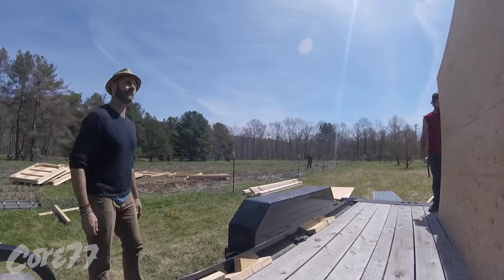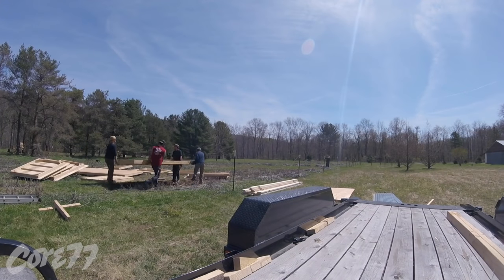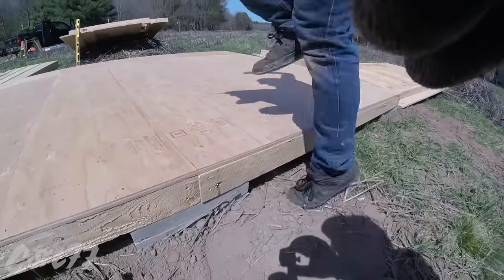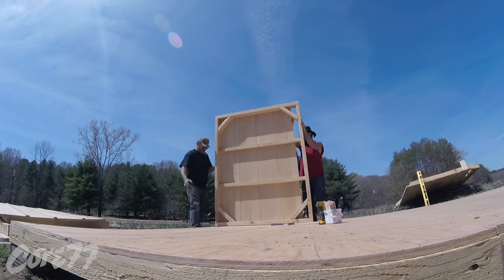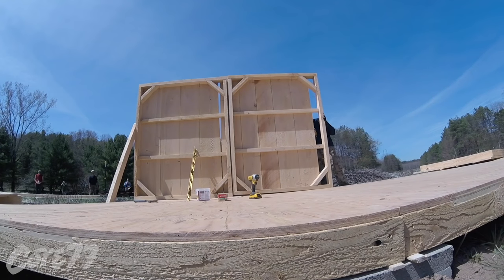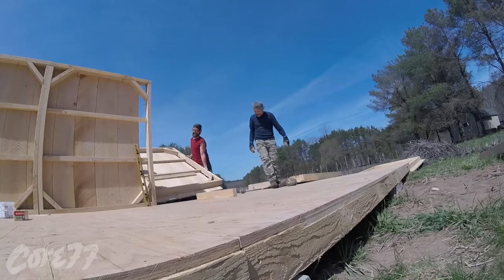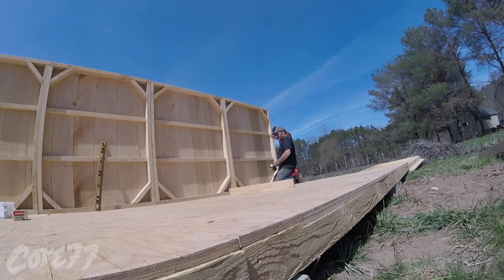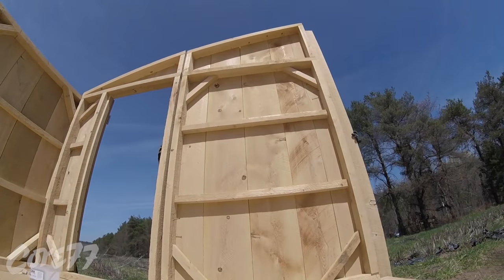You'll notice they're making a commercial too — Dave was filming, I was filming, and they were filming. It's got a lot of coverage. Those floor sections weighed about 250 pounds each — they were the heaviest parts. We were using timber locks toenailed into place — about 8-inch timber locks — and that really works well to pull everything together nice and tight. Each one of these sections got considerably screwed into place now that they weren't going to go anywhere, using those Starkey screws. You can see that airstrip, which is now an echinacea field. Slapping all these parts together took about 45 minutes. Considering it took nearly two full days to build, 45 minutes to put it back together wasn't so bad.